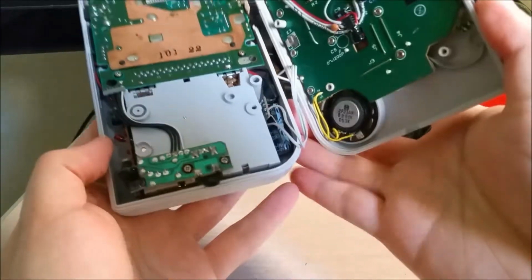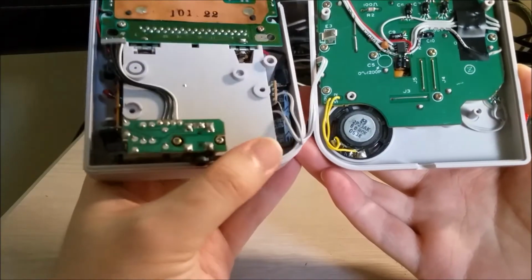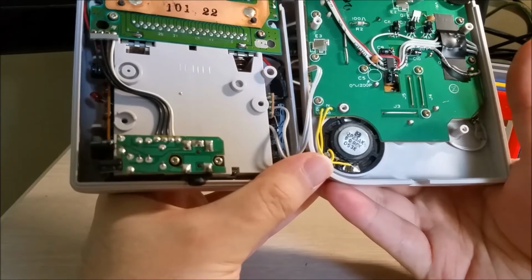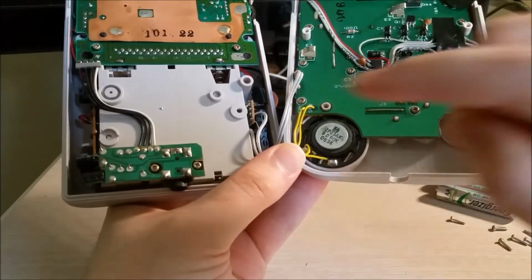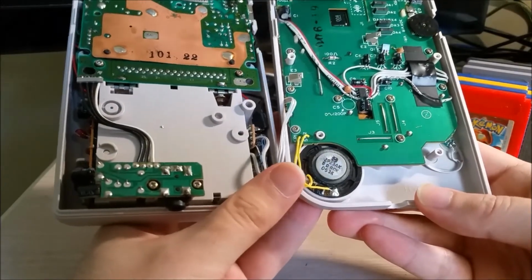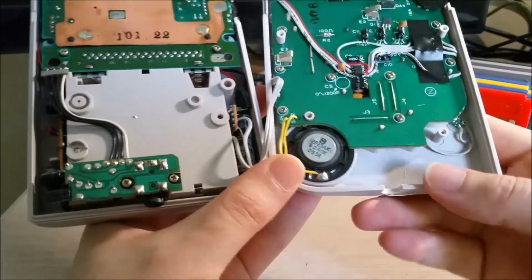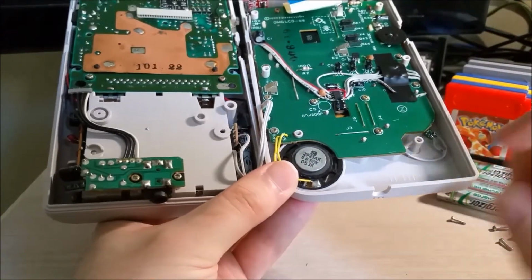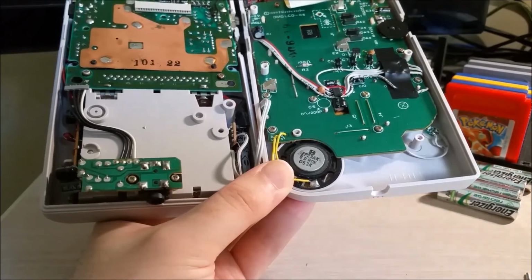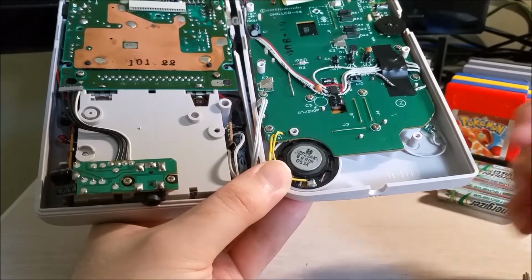Wow, yeah, you'd mentioned that he'd made some design improvements. I had suggested some ways of mounting the chips and stuff, but he had improved upon my suggestions for how to lay out the wiring. So yeah, you can see it just folds open like a book here. That's awesome. And he's installed some extra capacitors. So one thing I've noted on my installation, on my Play It Loud DMG with my chip, I hadn't done any extra capacitance on the power rail.